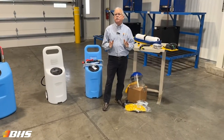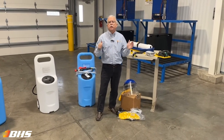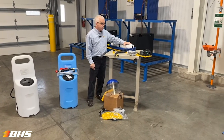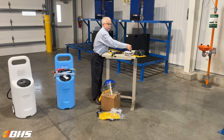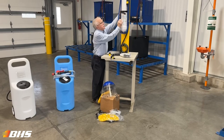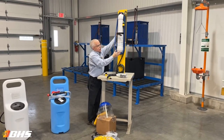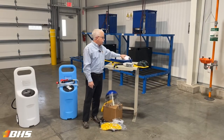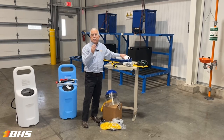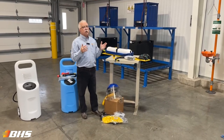A common question we get at BHS is: do we need to use distilled water or special water to fill our forklift batteries? You may want to look further into the WDS system from BHS — the water deionizing system. It would be affixed to the wall, and this replaceable cartridge is good for approximately an average of 600 gallons. The deionizer unit will remove any impurities or suspected harmful minerals from your water, keeping them from going into your battery and deteriorating the plate and the overall life of the battery.